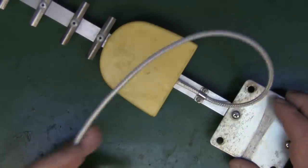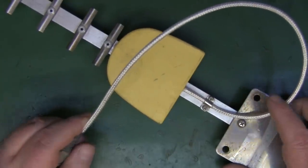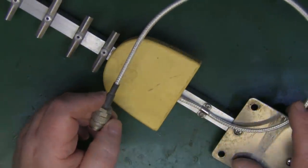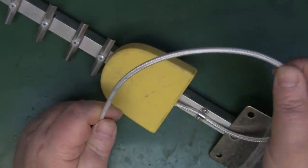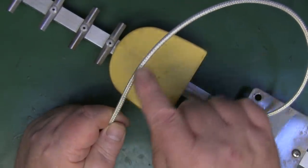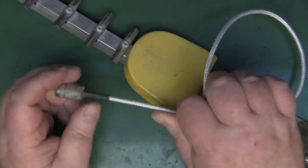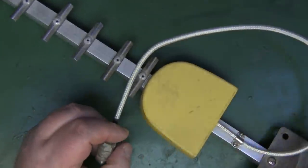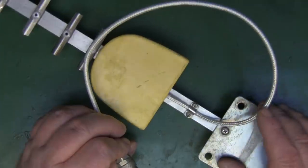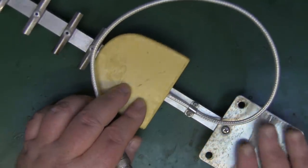One of the things that gives away this is a quality Yagi antenna is the coax. It's a short length going to an N-type connector, which is pretty standard for professional outdoor setups. The coax itself is really high quality — it's got a tight weave, making it extremely low loss. The weave is so tight it has an almost semi-rigid feel to it. I'd expect this coax to be extremely expensive if you tried to buy some, and using it really does make it stand out as quality kit.